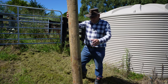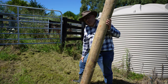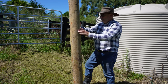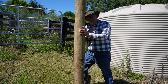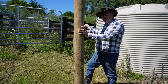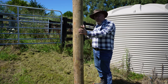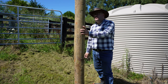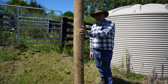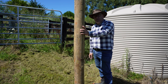We've got a number one round that we're going to use for this inside post. The only force on it is going to be directly down and into the ground. We're going to have a cross member — that's essentially where it gets its title, the H, from. Any tension coming from the line down there wants to pull that post over, but it's only passing through this one; this doesn't have any sideways tension. It's that post that's going to be taking the strain from the end of the wires. By having the post going across the top, as that one wants to lean in the direction of the force, the horizontal we're going to put in is going to stop it doing that. We're going to have a diagonal wire going to the foot of that one that ensures it stays true. It's that triangle of wood and wire that makes this assembly so incredibly strong.